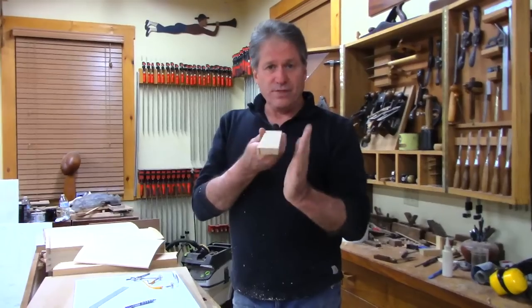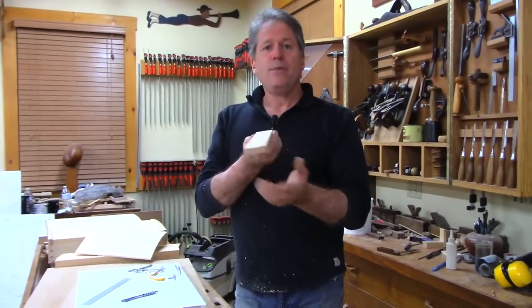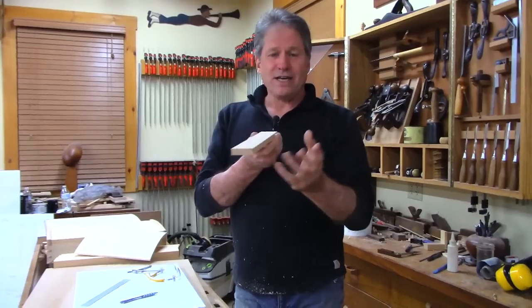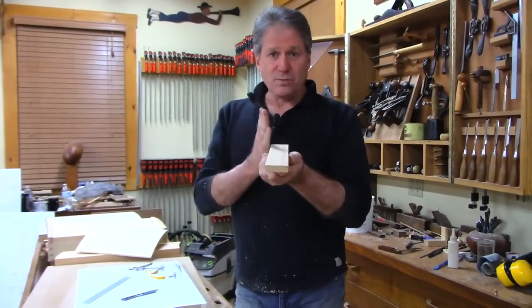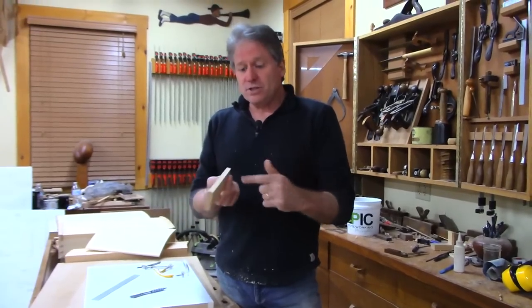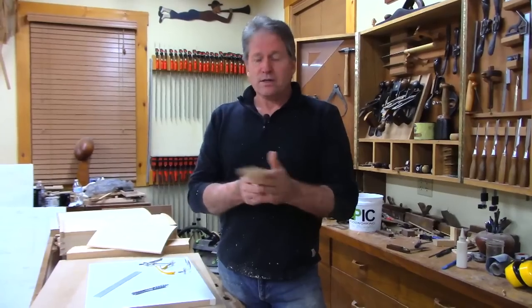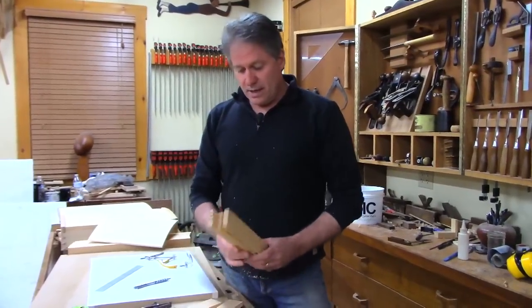If you did, then you would go to your joiner and you'd have to set it for a deeper cut. And yes, then you could go ahead and joint both sides. But sometimes on the joiner, you can get a little off with multiple passes and lose your parallel. So I like to just establish parallel and get the angle. If you want to clean it up on the joiner, you can. Like I said, the joiner is almost an optional step, because I could have glued that up and it would have been a pretty nice joint, because it was a pretty nice surface coming off there. But I just went that extra mile. Hope that makes sense.